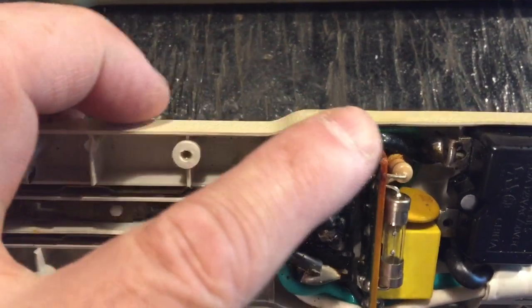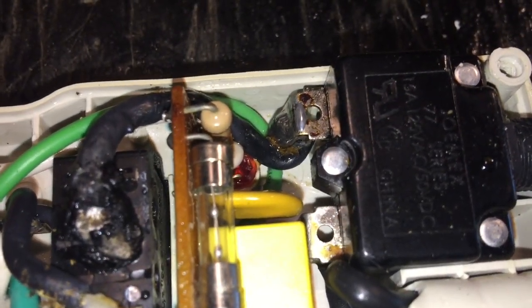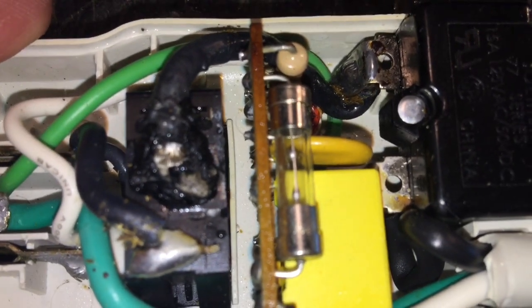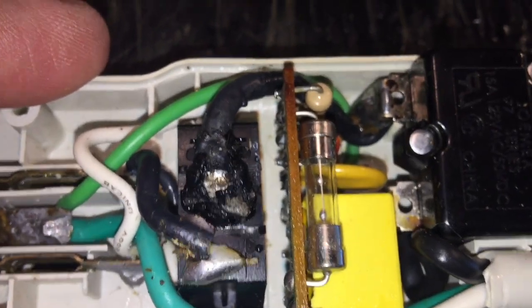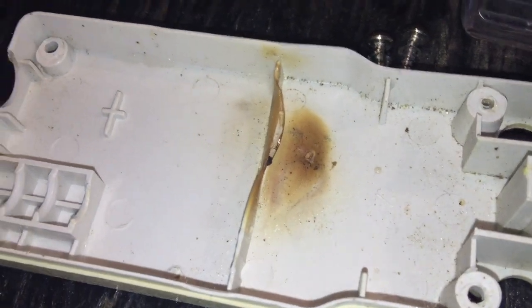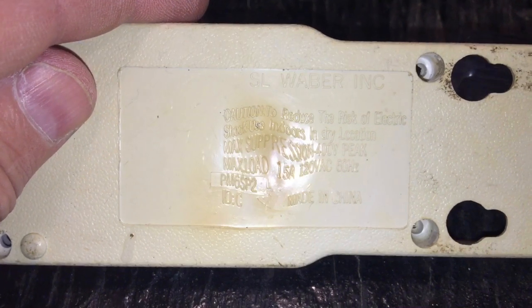The switch gave up the ghost and heated up that much — you can see the warpage on the line, kind of like bubbling right out. It's all pretty nasty looking in there, and you can see it got plenty hot because going right up to the breaker, that's pretty nasty looking. But the fuse — whatever that's for — did not blow, which is not confidence-inspiring. I would assume that's supposed to give up the ghost before the house burns down. That's a lot more melt and heat than I would have expected from something that has both a fuse and a breaker.